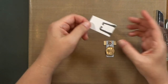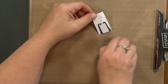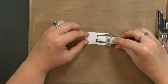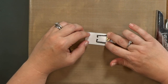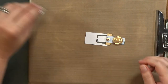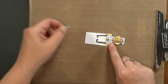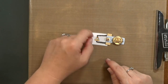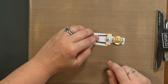Okay, so after it's dry, you would need to make sure that you have the pads connected. If you have any air between the two, there's not enough power to jump through the air there. It's only 3 volts. So you want that connected, and then you'd stick your light in place. Again, positive to positive, negative to negative side. And then give it a shot. Unfortunately, in this case, it didn't fire at all.